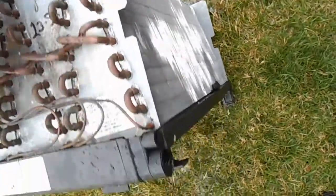We're going to go outside. Here's the dirty side — pretty rough. I've seen a lot worse, but it's definitely due for cleaning. After cleaning, it's nice and shiny. I'm going to use the fin comb set to straighten up some of these bent fins before putting it back in.